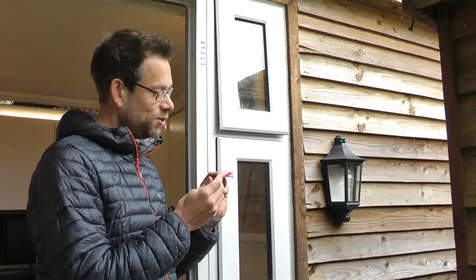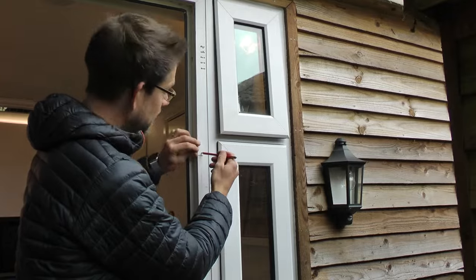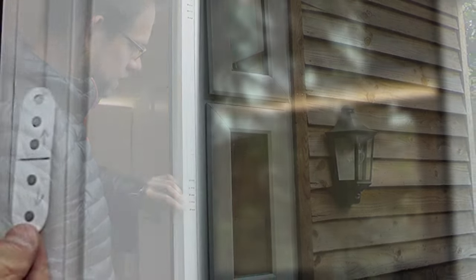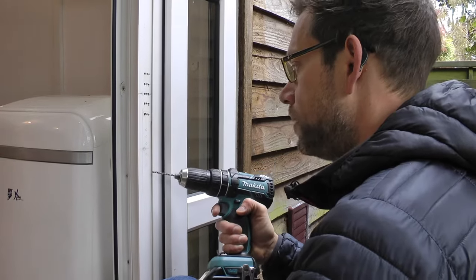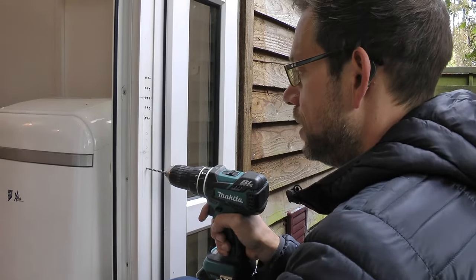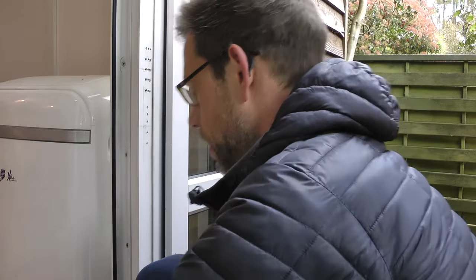In order to make sure the hinges are mounted on the frame at the right depth, I've invented this very technical little tool - a bit of plastic angle from my garage with a notch cut in it exactly to the right depth. I place a pencil in that notch and run it up and down the door and it gives me a perfect guideline to mount the new hinges. This is the template I made earlier with a center line, an upwards arrow and a downwards arrow so I can't get it wrong. I line it up with the center arrow, make sure it's to the edge line, and mark the holes for each of the four hinges. I'm using a metal bit because behind this UPVC there's a big old lump of metal. The bottom two holes are for the guidance pins and the top three are for actual screws.